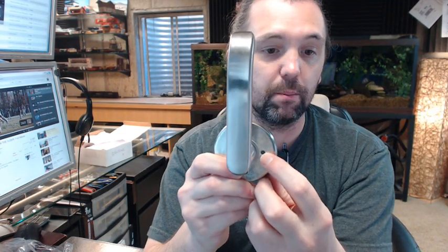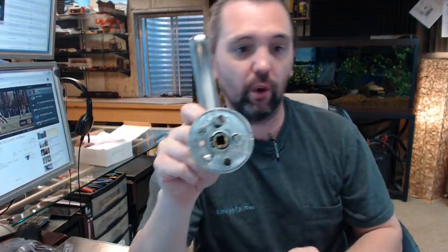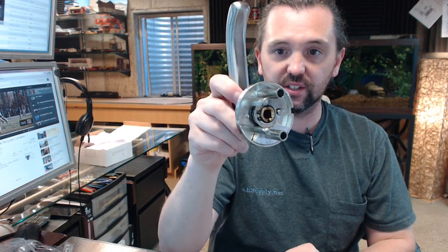Your jamb is over here and this door is going to slide this way. While it's facing the door from the exterior, this is what it looks like — so if you walked up to the door it will go to the right to open. Conversely, this is the interior, and I know it's the interior because of a couple of things. The privacy pin hole is going to be to this side, which would be the opposite or the pocket side, and it's got these two large posts here as well, which also indicate it's different than the exterior.